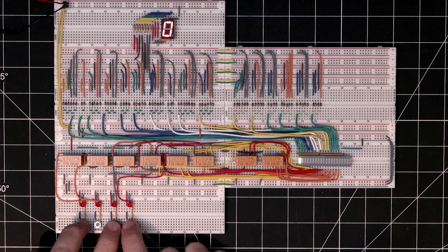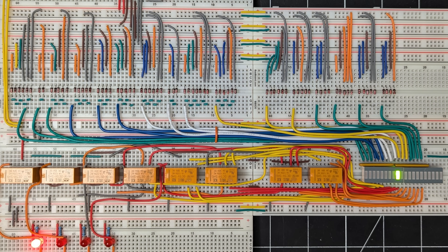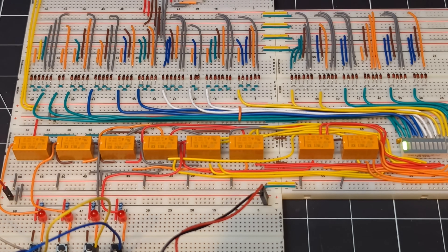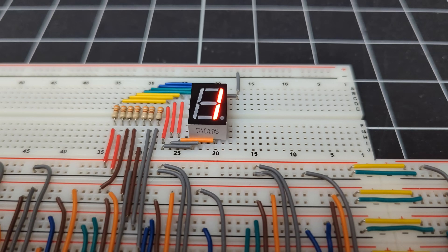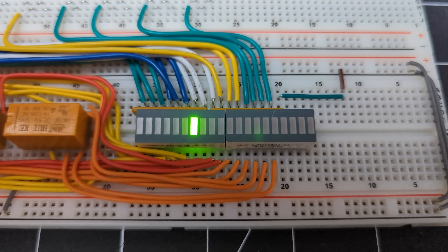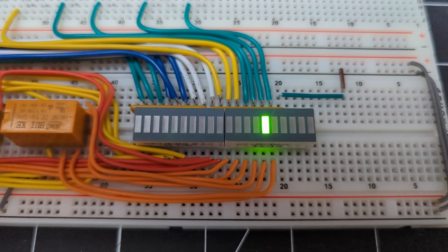It is 3:07 a.m. and I may have gotten a little carried away with this one, but it was a lot of fun. I really just wanted to see it decoding the four bits into a hex value, which looks like it's working just fine. I just need to now duplicate this circuit to decode a full byte. I have it hooked up to an Arduino and a relay module, and I'm going to put it through some paces to exercise those relays and diodes and make sure there are no gremlins left. I'll end off with some of that footage — thank you so much for watching and I'll see you next time.